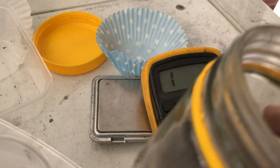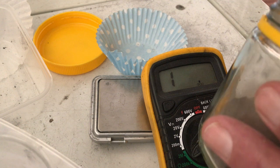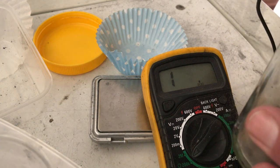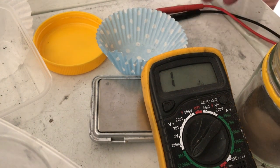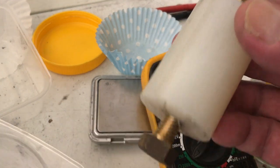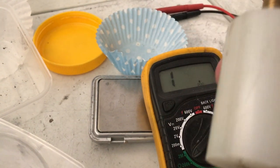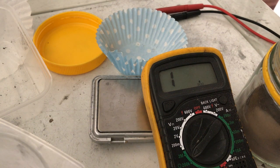This larger stuff has even a bit of rock left in it — it stripped the graphite off but shows no measurable resistance. I've made a device where I can pack the center with graphite and compress it with screws to get a better resistance reading. I'll do pre-processed and then processed resistance tests and see what we get.